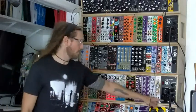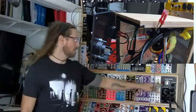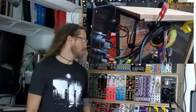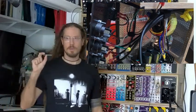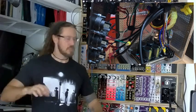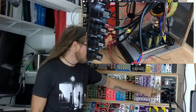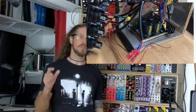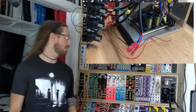That board set wouldn't fit in anything smaller than a 3 wide, and that bummed me out a little bit. I was hoping I could make it smaller, but by the time I put my toroidal transformer in here, I needed the space anyway. And even just the wires. You're not talking about hookup wire anymore. You're talking about the thicker 2.4 amp wire that, once you get it all wadded up in there and you've done radial distribution across 4 outputs plus all the internal wiring for the back of the... It takes up space, is the point. Wire management always is the thing that surprises you, and you just have to go in prepared for it. You have to leave room for wire management.